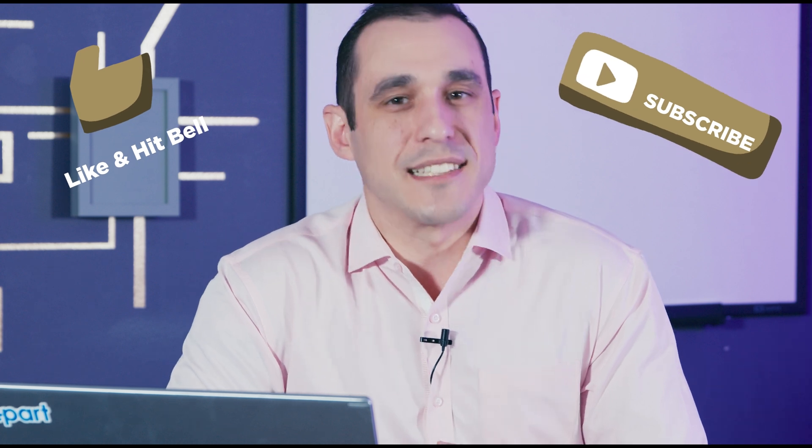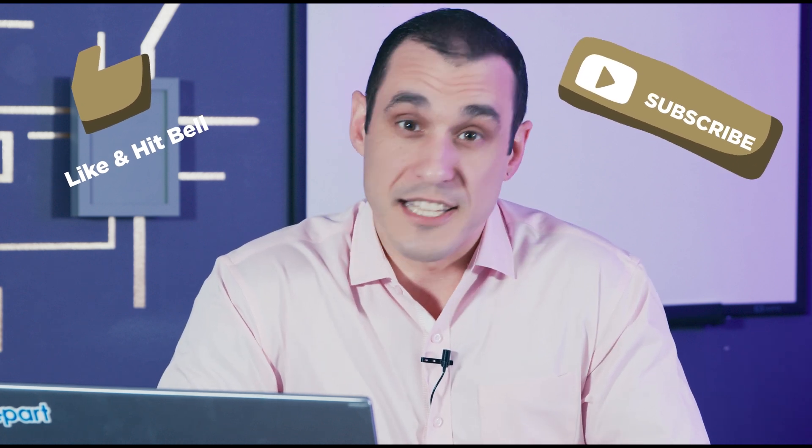Make sure you size that capacitor so that its capacitance is larger than the capacitance across your transformer. If you do that, you will provide a path for high frequency currents rather than allowing them to radiate into free space and causing you to fail EMC. Thanks for tuning in, everybody. Make sure to hit that like button, subscribe, follow me on LinkedIn, follow Altium on LinkedIn, leave your comments and questions in the comment section, and don't forget to call your fabricator, folks.